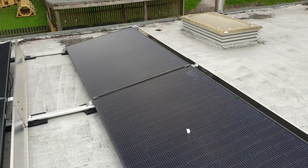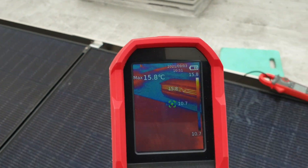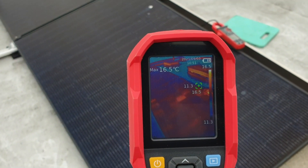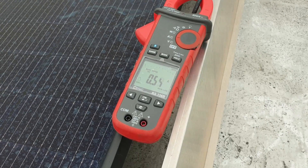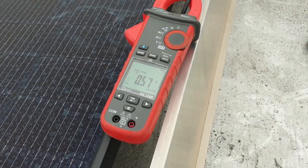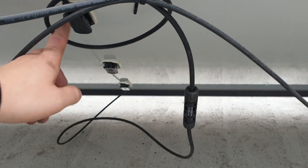Actually I was wrong — it just wasn't part of this string. You can now see that the two at the end have calmed down, but this one here you can still see all the cells despite the fact I've now turned the string off. We still have generation on this panel, which means this panel is just connected to itself, which isn't really very helpful.